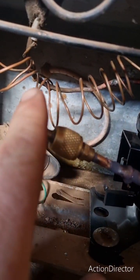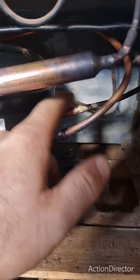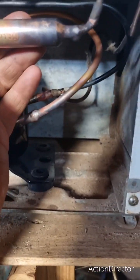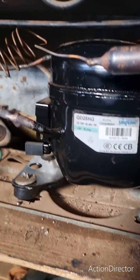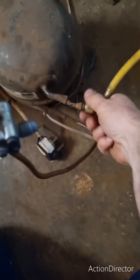The whole thing is up and going — all the piping has been done. In this case the old cooling line was too short, so I had to lengthen it and swing it all the way around. The heating line is up, I've got a new 15-gram dryer in, and the welds are done. Remember: it doesn't have to look pretty, it has to work. I coiled the rest of the capillary tube, ran a vacuum, and it's staying steady — so it's time to charge it up with R134a.